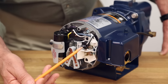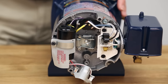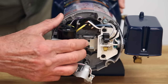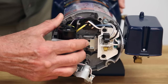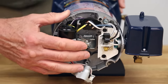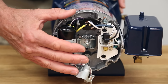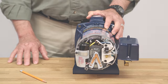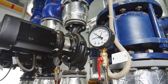This covers the components in the back of the motor that you need to be aware of. Let's say we have installed the pump and we have heard the centrifugal switch click, which indicates that the motor is up to speed, but performance is low. The bladder tank is filling slowly but not reaching shutoff pressure. Check the pressure gauge to see if the pressure is consistent. If the pressure or amps on the motor keep fluctuating, we have an air leak on the suction side.